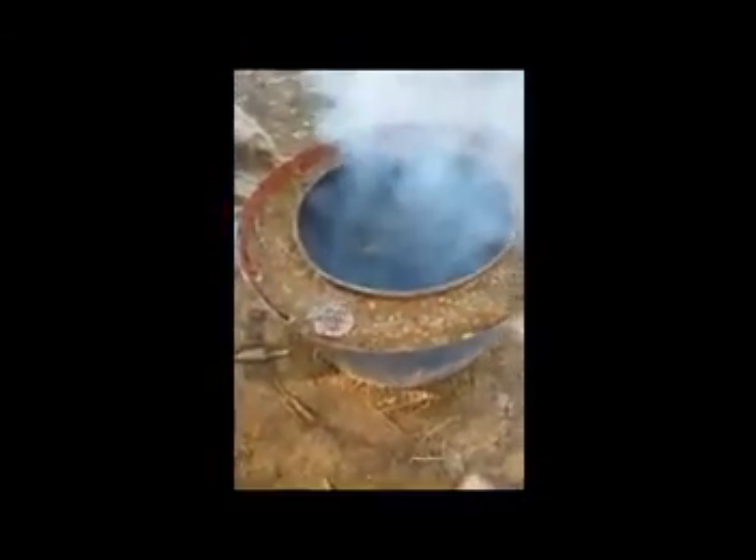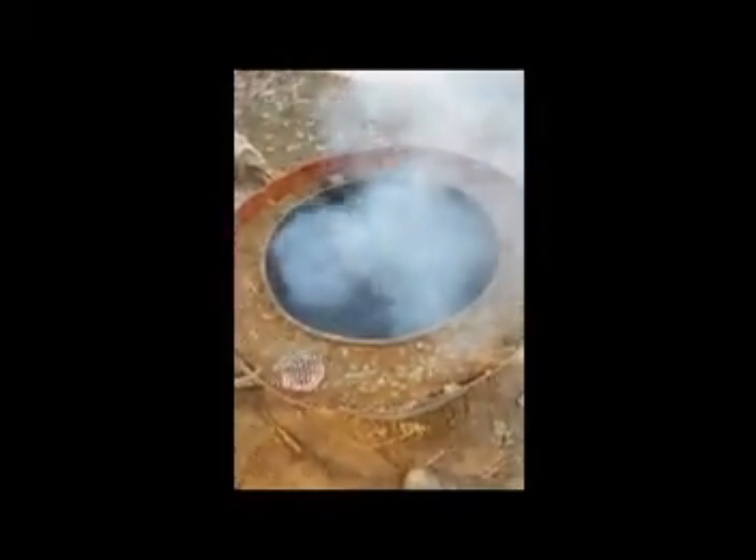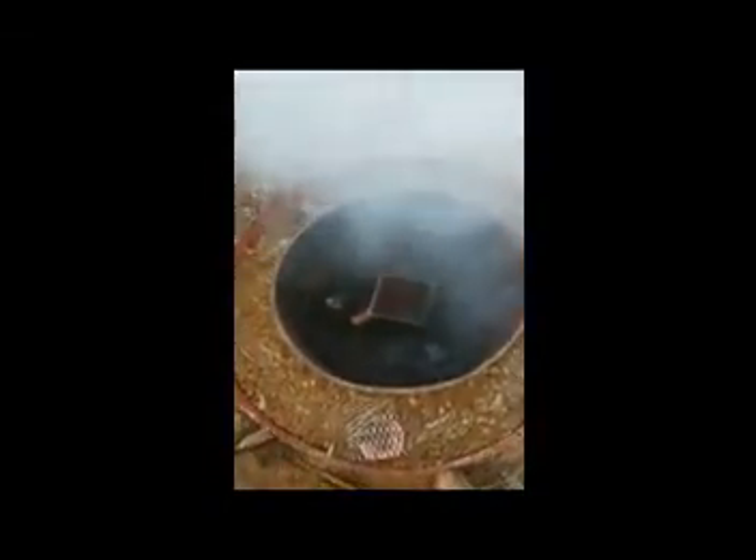I had that little fire going, then I pushed all the coals out to the side, put my crucible inside, and poured the rest of the bag of charcoal in around the crucible. You can see it's smoking quite a lot, but I think once the fire takes off through the coals the temperature will come up quite a bit and that smoke is going to die down.